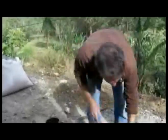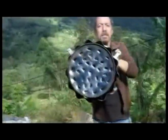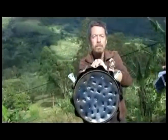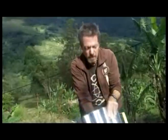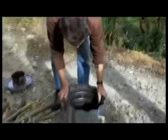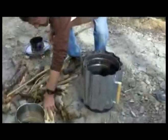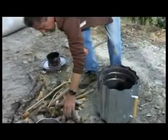We're going to build our fuel pile in here so that the primary air entering in the bottom can still filter up and ignite the little tinder fire that we're going to build on top of this pile. These are top-lit stoves — top-lit updraft gasifiers. Put it on a relatively flat piece of ground because we want to control that primary air. Then start with our bigger pieces on the bottom and build our fuel pile.